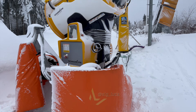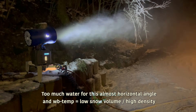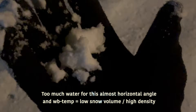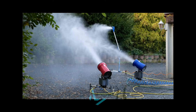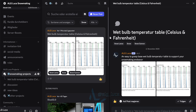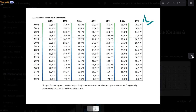An important thing to note is that the amount of snow you can make is limited by the environment you are operating in. This is a combination of temperature and humidity. Basically, when water vaporizes, it has a cooling effect — this is key. In snowmaking, you are generally limited by the wet bulb temperature, which is the lowest temperature you can achieve through vaporization. There are multiple websites with calculators, and I also have a table sheet on my Discord server where you can check your current wet bulb temperature based on temperature and humidity. Link to that in the description.